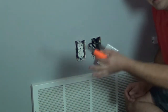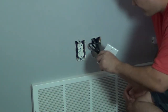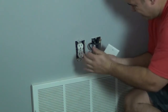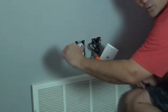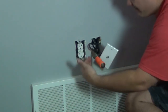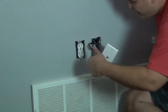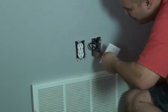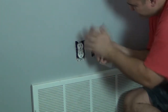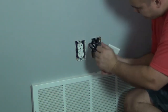To do that I'm taking a big flat-handle chisel, sticking it between the box and the stud, and prying away from the stud. If you pry towards the stud you'll beat up the drywall and when you put the faceplate back on you'll see the damage. It's a little harder but push the box away from the stud — there's a nail at the top and a nail at the bottom and you've got to break those two nails loose.